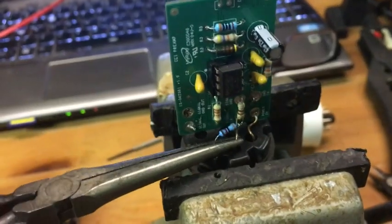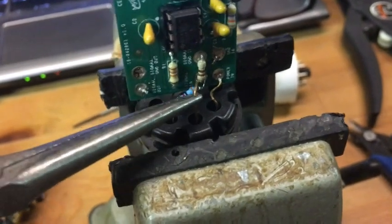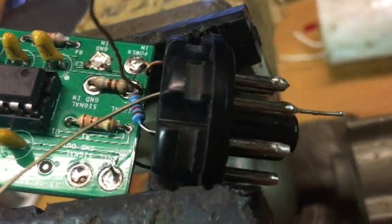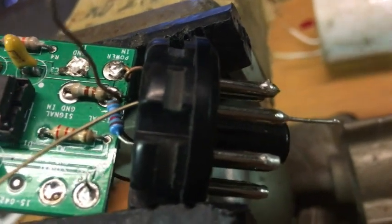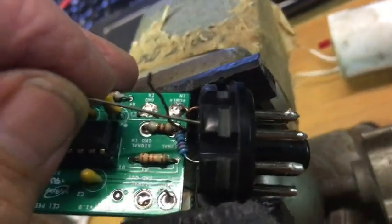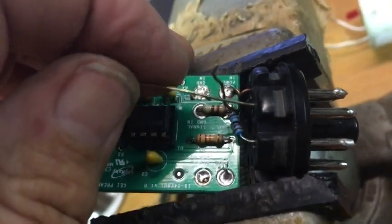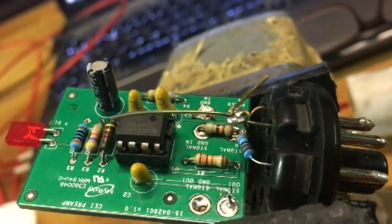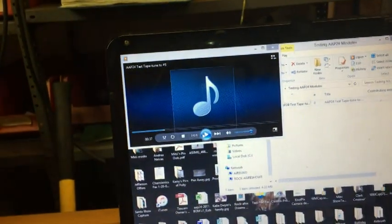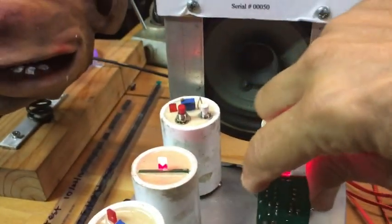This one looks good if you're just looking at it. I didn't want to put any stress on that wire that's already connected to the board, so I put a fresh wire in the pin, pushed it all the way through, and soldered it at the end with a nice little sort of mountain on top, then I'll cut it off. Now I'll wrap this wire around that wire. I soldered it and now I'll just trim off the excess. Lights come on, passing tones. And does it scratch? No, sounds alright.